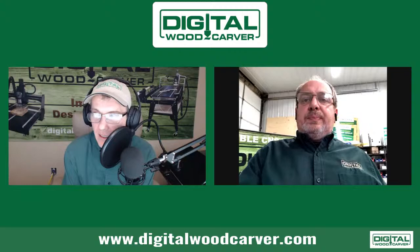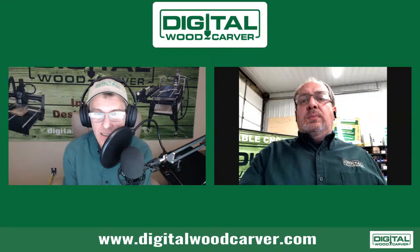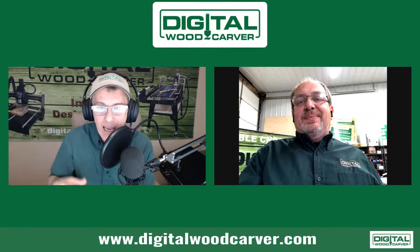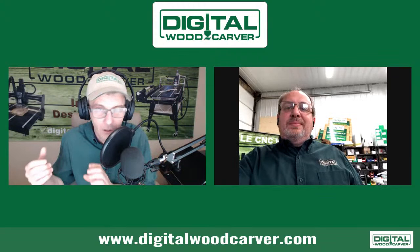Exactly. And guys, that is a good point. Someone last week, when we mentioned that we were going to be showing the fourth axis and we were showing the laser the week before that, asked, hey, does the laser work on the fourth axis, to do pins or things like that? And it does. That's one of the things we wanted to show you tonight, but unfortunately we didn't get there. But it does. If you have your pin mandrel, if it has a number one Morse taper, you could very easily take that pin that you've turned on your lathe and bring it over to the fourth axis, put that pin mandrel in there and do a laser engraving.